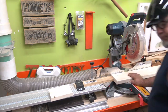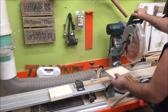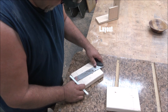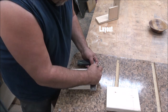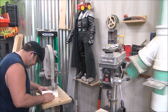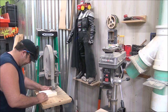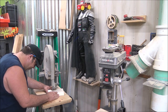I started with a two-by-six and cut two eight-inch sections off one end. To lay it out I put a line one-and-three-quarter inches up from the bottom, then measured over two inches from the side and put a line there. These are going to work with a wedge — I cut the wedge right out of this two-by-six block. I just kind of eyeballed it; the exact angle isn't really critical. Then I cut those two lines out on the band saw, but I didn't cut the bottom out yet.